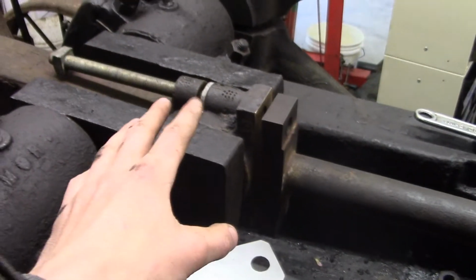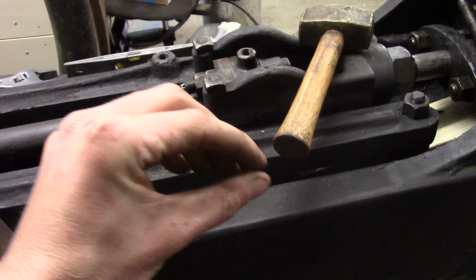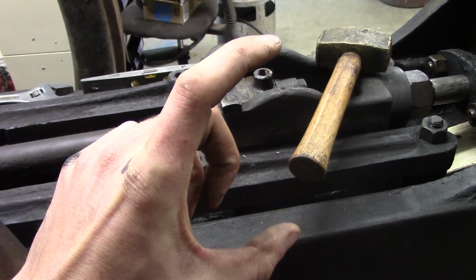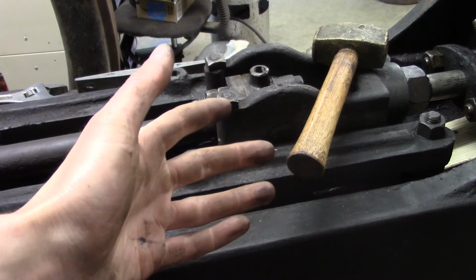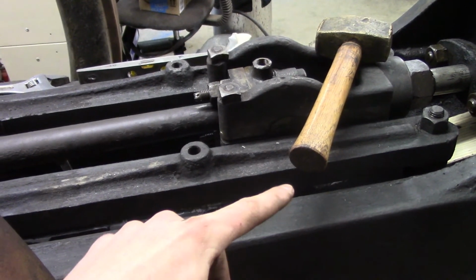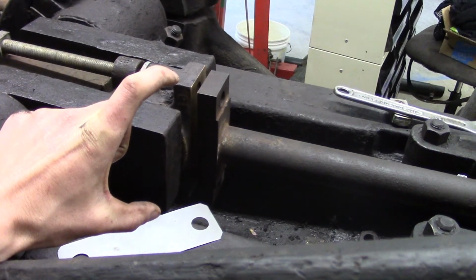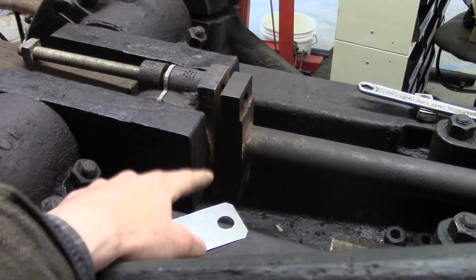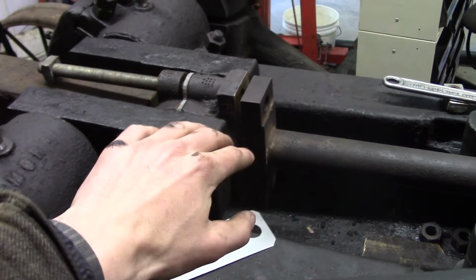Now, that's an important consideration because if you guys remember, my damming failed here, even though I wasn't filling it very deep. Now, the deeper you go, it's just like diving underwater or anything. The deeper you go, the more pressure you're going to be under. The same goes for Babbitt, because it's a liquid when it's molten, and the deeper of a pour you have, the more pressure the damming is going to be under. So since this is very tall, maybe 6 inches or so from top to bottom, the bottom part of the damming is going to be under a lot of pressure, and you're going to have a lot of damming to hold it all back.